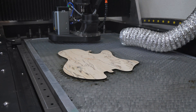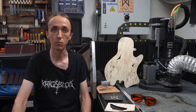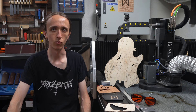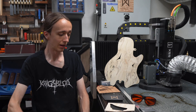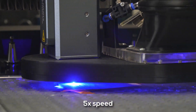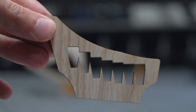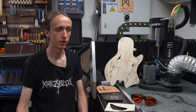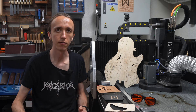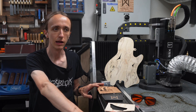It's never going to get all of the smoke, and if I were doing laser cutting all the time, I wouldn't use this system — I would get a dedicated laser cutter or have an enclosure for this machine. But for just using it periodically, there aren't that many pieces of a guitar where I actually want to use a laser cutter. Cutting out the headstock veneer is one piece that is easier with the laser instead of the mill, and cutting out the top also proved a bit easier as it has some very small details where I would have had to use a tiny tool. But for the most part, I'm just using the engraving function. This is more just to augment this CNC machine, which 95% of the time is using an end mill and not the laser.